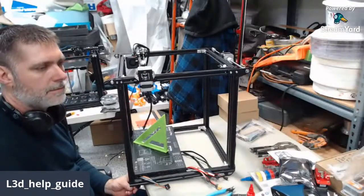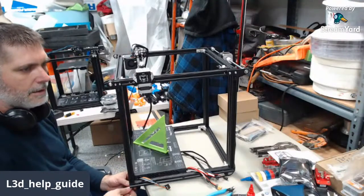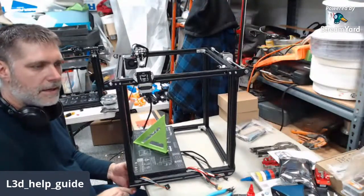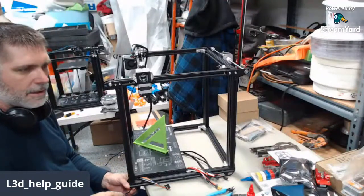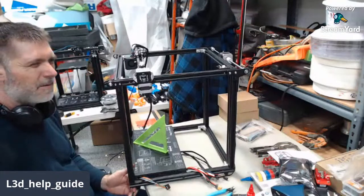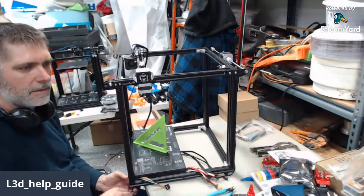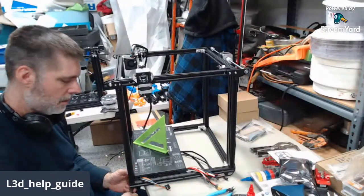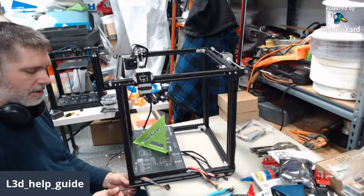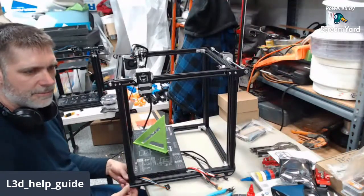You can actually do a self-test if you wanted to. Take your fan off, heat the hot end up to about 200 degrees, put the spacer in there, and if you wait for about 35 or 40 minutes with no cooling, it'll finally get hot enough to start softening up the washer. But I assure you that as long as your fan's working, it won't get above 40 degrees or so up in that part of the hot end, and you won't have any problems.